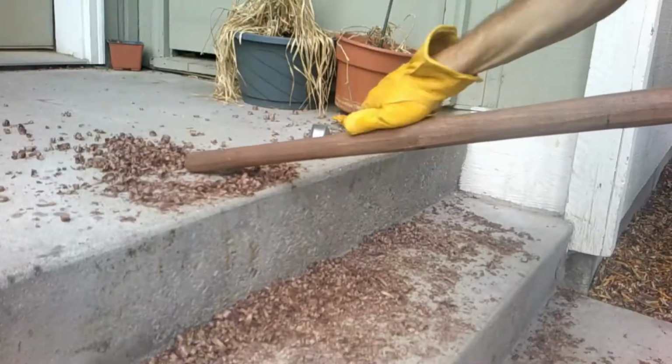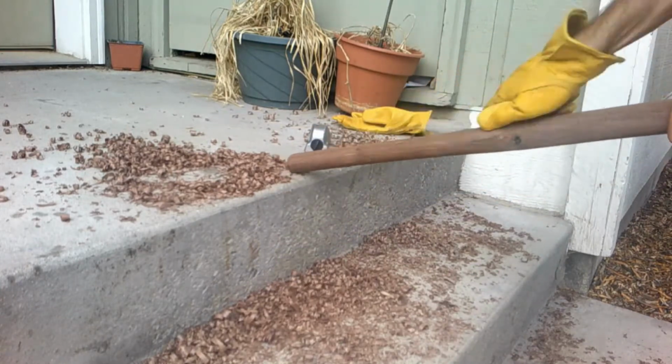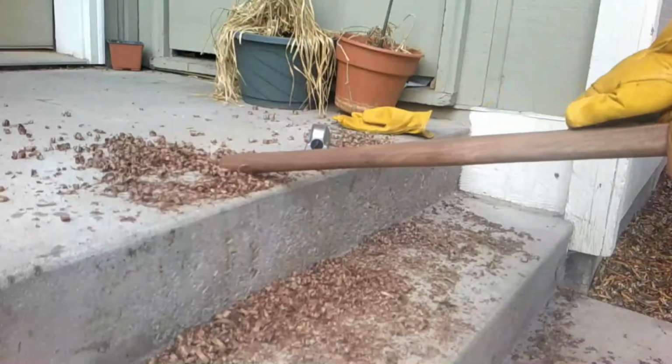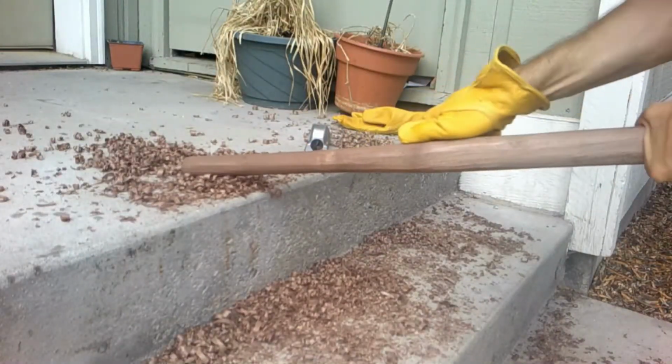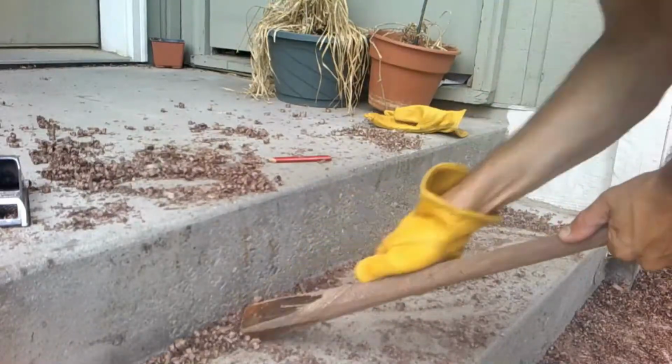Oh, by the way, I'm gonna put in some footage of certain sticks that I've done for my YouTube channel. This one here, I probably need to put more oil on it, but it's bare. There is no surface coating on this one. I didn't do boiled linseed oil on this one. I haven't done boiled linseed oil in like 3 years, and this is the main reason I switched. It was gumming up on my wood. It was making a mess. It was a pain in the neck. I just couldn't deal with it anymore.